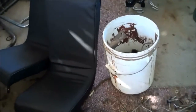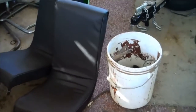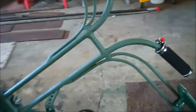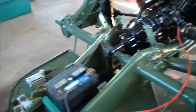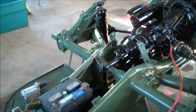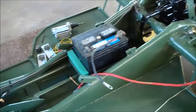You'll need some sheet metal for the seats — I usually use galvanized eighteen-gauge, which is plenty heavy enough. Pop rivets hold that all together. For some of the decorative material, this particular one I found some three-eighths round stock that we bent into a nice shape. You can use whatever material you have — I've done some in round, square, hex — whatever material you like; that's a style point. And that's all the materials I can think of that go into it — there's always a few little odds and ends, but that's it.